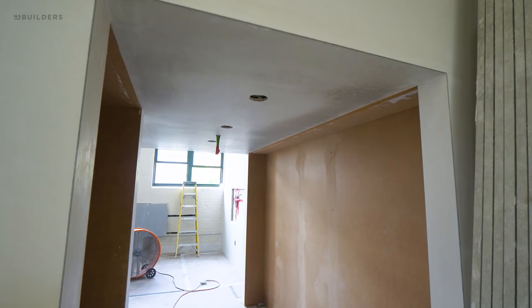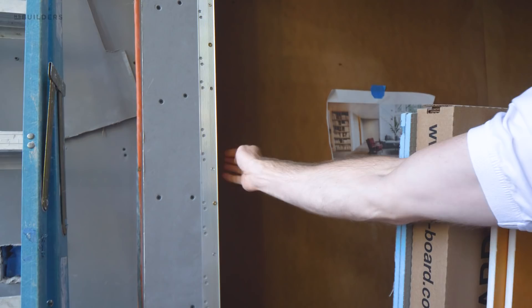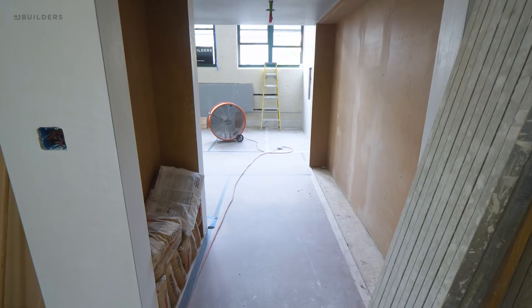This allows us to make the transition from a painted plaster wall to a painted case. However, we had to marry those two materials somehow. With the help of some friends over at Fine Line Millworks in Indy, we came up with an idea to transition from combo core to plaster that required making a modified mud flange and epoxying that straight to the combo core. We also screwed it in to make sure it really wasn't going to move. This allowed us to screed the plaster right off of that mud flange, giving us a nice flat and smooth plastered face.